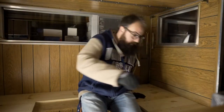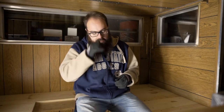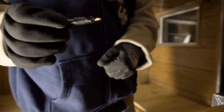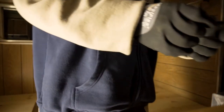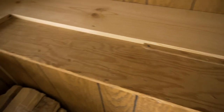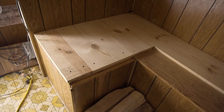I just picked up these countersink bits — I didn't have any before. I was going in by hand and getting a lot of chip-out in the wood. I bought these and they work pretty well. I did have one break on me after seven or eight holes — that could have been because I torqued it weird — but other than that they're pretty good. They helped me do most of this, and they set the screws down pretty well. There's my little extra piece I had to lay down, and the table is going well.